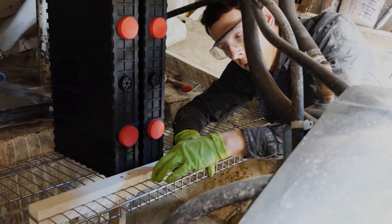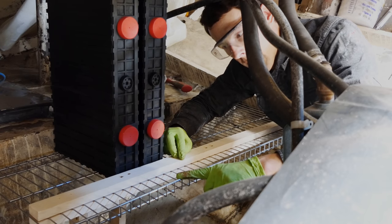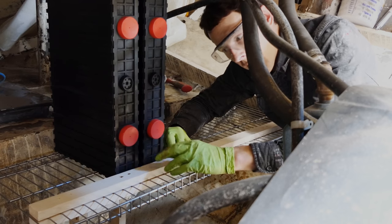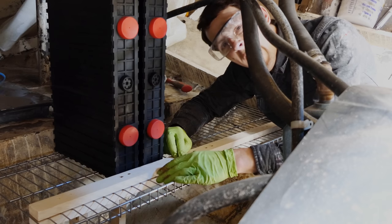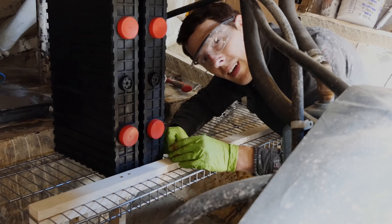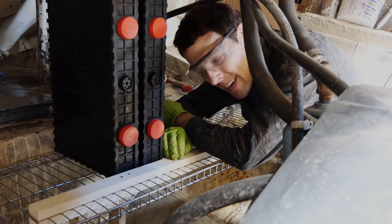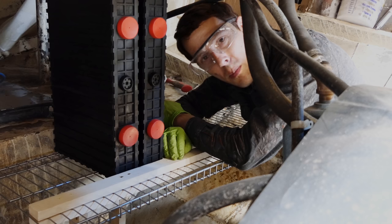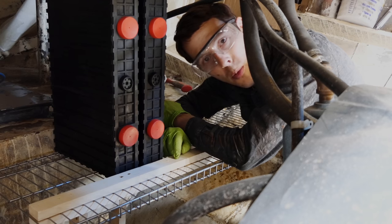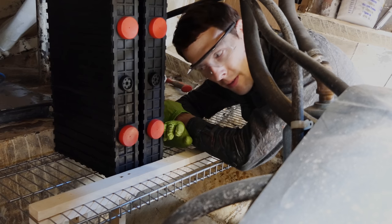I think also I'm gonna fit a couple of strips of wood in between this and the front of the grate, just so that if anything really bad happens and we get a big knock, this won't slide on its own. And then on the bottom, since this is kind of a temporary thing, temporary-ish, I don't want to add any welded brackets or anything like that to the boat, so I'm just going to use sealant, some 3M 4200, and I'll put it on the bottom of the feet after everything is painted.